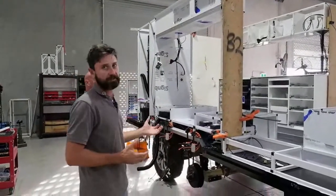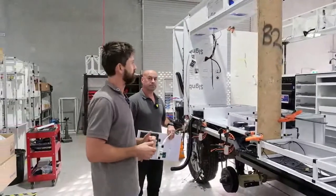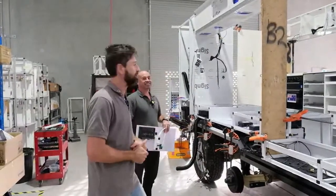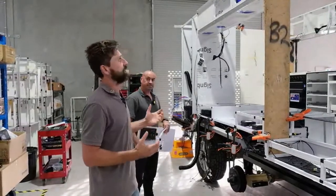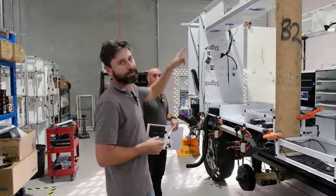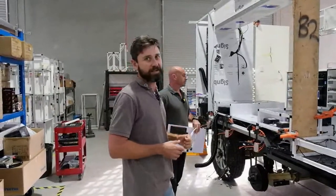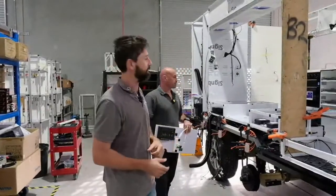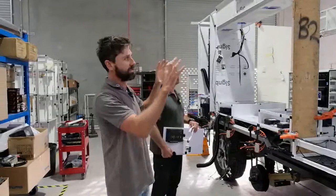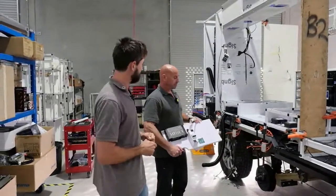It's a bit of a funny joke around here, because when we first got into the caravan industry, I remember going into a van somewhere and the salesman telling me how good an off-road caravan it was because he could do a chin-up off the overhead. And I thought, okay, that's an interesting way to show that the overhead's not going to fall off. But genuinely for us, with the glues that we're using, we do some calculations and look at the shear strengths of these glues to the extrusions and then the fiberglass, and we're seeing numbers of like 6 to 8 ton to be able to move an overhead off the roof or the wall. So obviously never a number that you're going to be able to apply in real life, but this stuff, once it's all put together, is really, really strong.